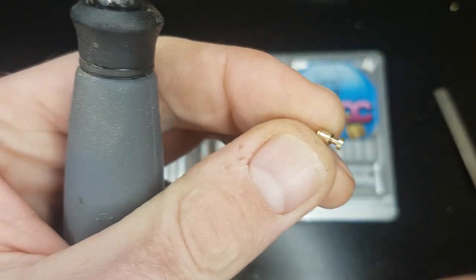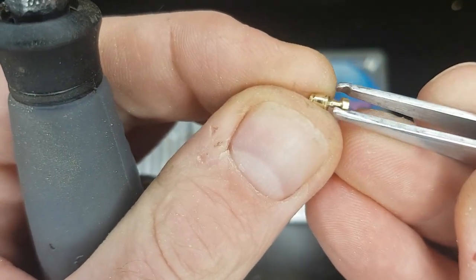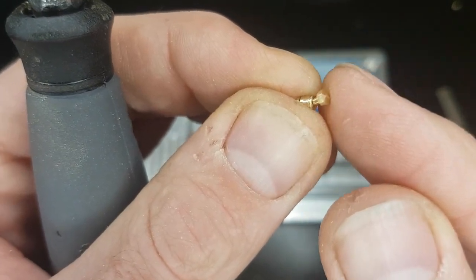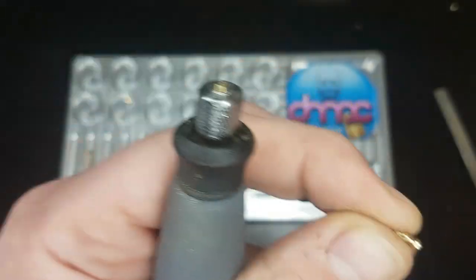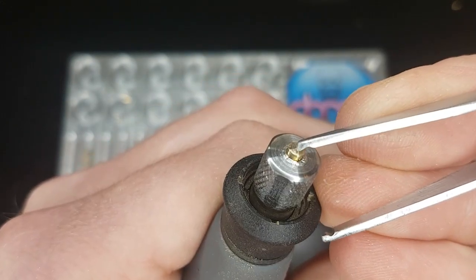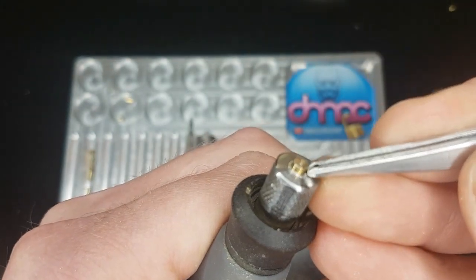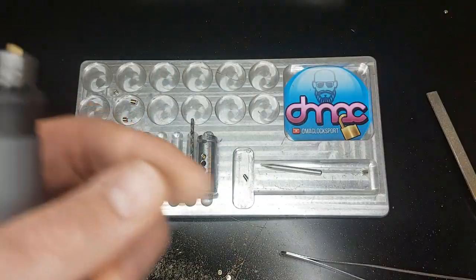The way I made this one — and it seemed to work — this section here is like a T-pin, but on the end I've left a sort of ball section, so it's essentially a ball joint. What we need to do is make a recess in here to receive it, and then in order for the ball to locate in there we need to machine a channel around the inside. So we're going to use a pin vice with a one mil bit.